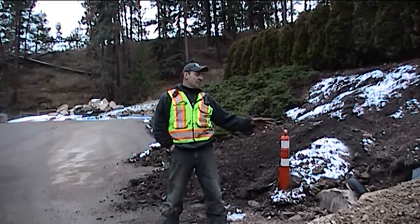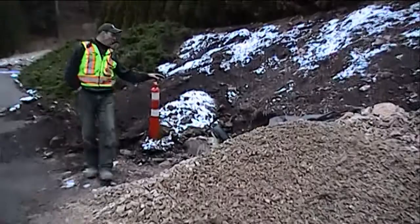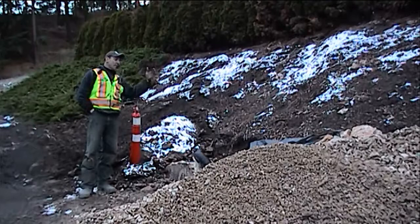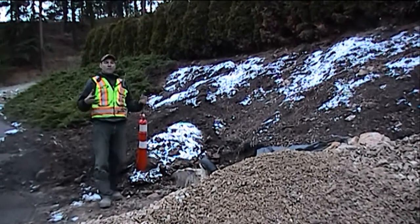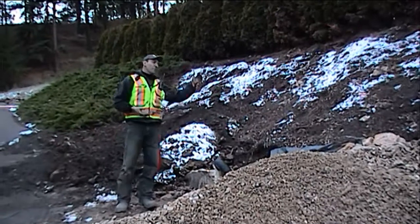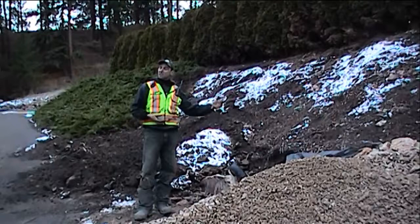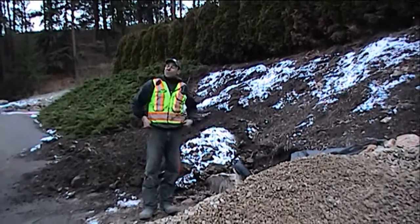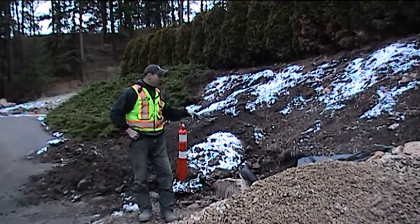We have some drain rock here. We got a variety of chunk, and in behind this wall that I'm going to start to show you, there's Big O and there's a lot of dry stack, and that's the proper construction of a wall. So you get drainage. We put filter fabric in behind, and if a water issue is coming as a spring issue or something, or an irrigation line might eventually break, we always try to prepare for the worst. So we put Big O on the bottom.